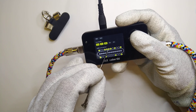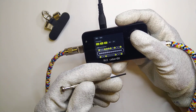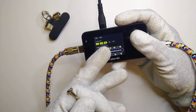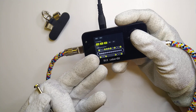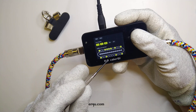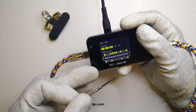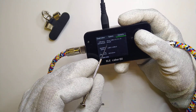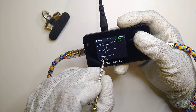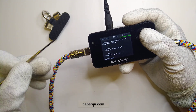We can see the required pinout for USB-C USB 2.0 data transmission: the D+ and D− pins as well as one of the CC pins, which is responsible for power negotiation. When your phone connects to a power supply it knows power can be supplied, but when two phones connect they have to talk on the CC line to determine which phone charges in which direction. If they agree on charging, they use the VBUS and ground pins to transmit power. Interestingly, they connected not only VBUS, ground, CC1, D+, and D− but also the shield, so the cable is shielded or at least the shield and ground pins are connected inside the connectors.